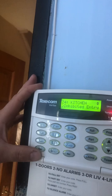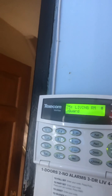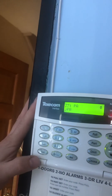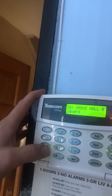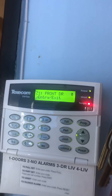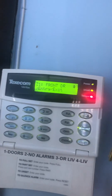The hallway in this case wants to be inhibited access because you need to go through the hallway. The kitchen is also an entry route. The living room and landing can stay at guard. Zone seven is the panic button — change that to panic. Zone eight is the hall smoke detector — change that to four for fire. And that is the zone setup. Watch for my next video on how to part-set zones. Please like and subscribe — have a great day.